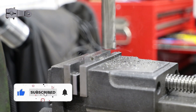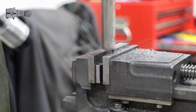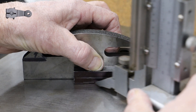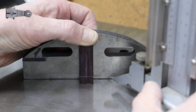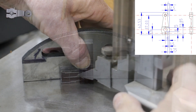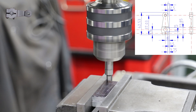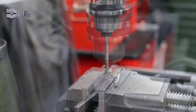When I convert the detail from Don's drawings from imperial to metric, I don't just whip out my calculator and substitute his dimensions with the nearest metric equivalents - I actually transfer the details into a CAD package. This is just a free package I'm using, LibreCAD. One of the advantages of doing it this way is I can easily reorientate all of my dimensions, so when it comes to marking out things like this return crank, it becomes a relatively simple job to take the dimensions from my reference surfaces - in this case one of the long sides and one of the ends.